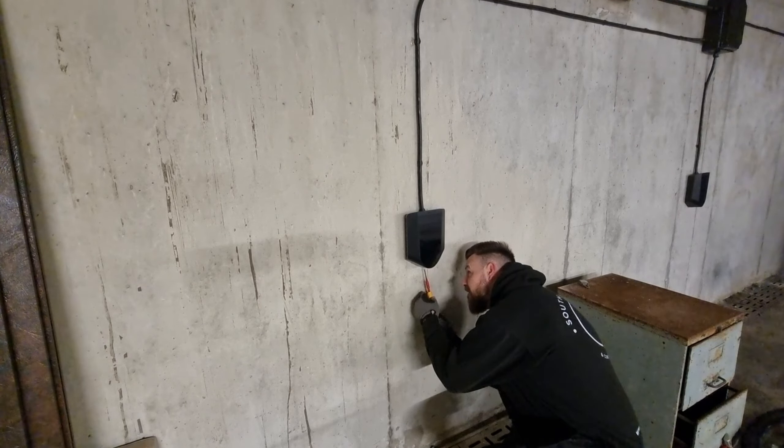We've made it back down to the car park. It's a new week — we went for a beer after the plant room scene. Second row is wired and just needs second-fixing. Third row: the sub-main is running down, just the 6mm drops out of the whisker boxes to go. We've made some good progress but it's taking a lot longer than thought. Sub-mains are down there — just need to pull that one down, finish the adaptable boxes, and we can wire the chargers. It'll be a nice job at the end.